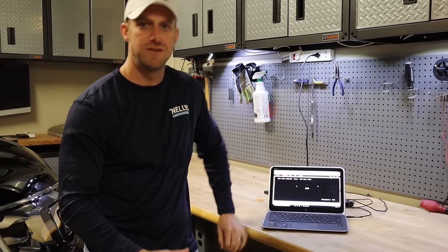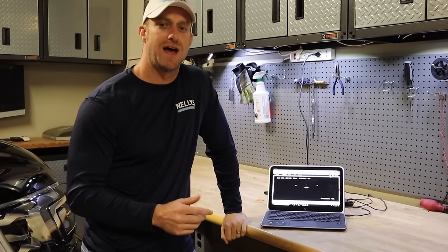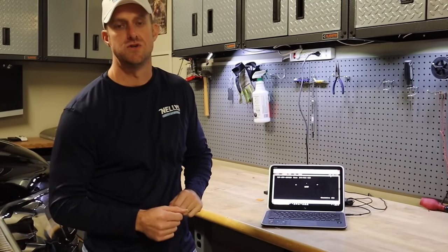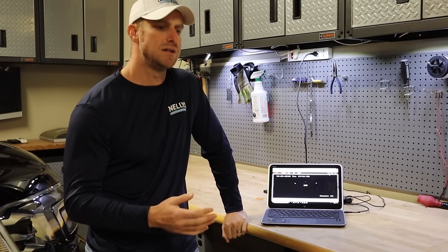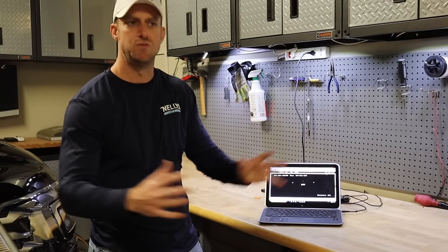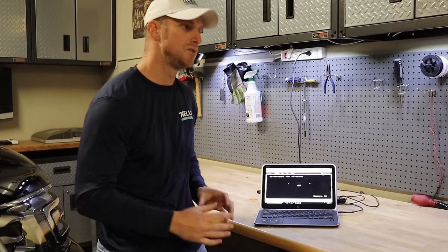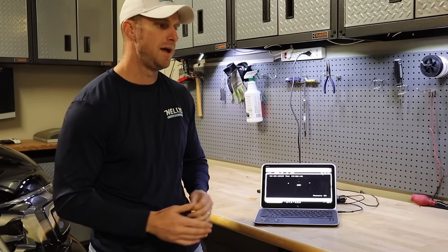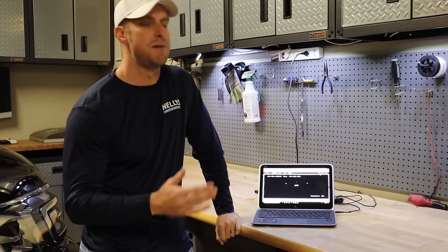I've finished filming the 15-foot, 50-foot, and 100-foot shots. One thing I found is it's a lot more difficult to capture license plates at night than during the day. But the thing that will really increase your chances of success is determining a focus point — a choke point — where that license plate is going to pass by. You can't expect a camera zoomed way out to capture plates at 25 feet and with the same settings also capture plates at 75 feet. Determine the distance you want, find a choke point, position your camera, and adjust your settings accordingly — that will dramatically increase your chances of success.